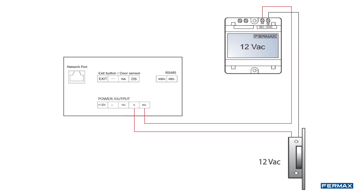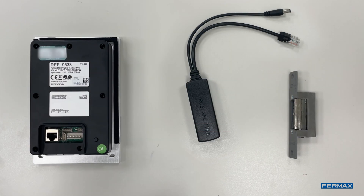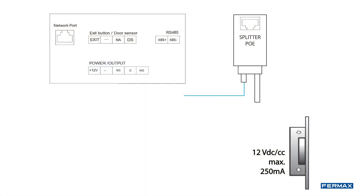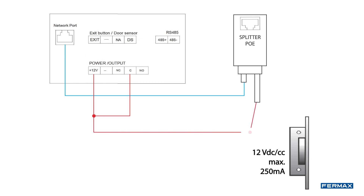Now we will show how to install a basic low voltage door lock with a PoE splitter. When we talk about low voltage, we mean that our door lock does not consume more than 250mA. The PoE splitter will have to be stripped to splice the two wires of the door lock. We will begin by attaching the Molex connector to the panel and connecting the PoE splitter from the switch to the panel. Next, we will connect the red plus 12V cable to the blue C on a power strip, and from there splice it to the positive cable of the splitter. Now we will connect the negative black cable of the panel to the negative of the PoE splitter, and from that connection to the door lock. Finally, we will connect the brown NO wire to the other input of the door lock. In this way, the wiring is already done.